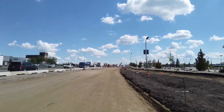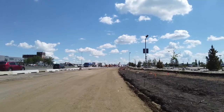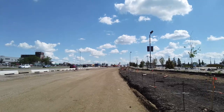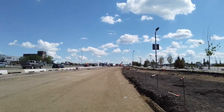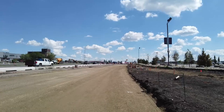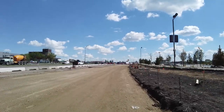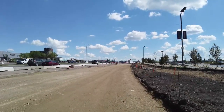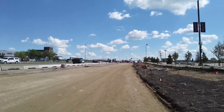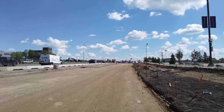That's a difference of 2 centimeters. If they use the trimming head, we normally leave it 2 centimeters high to give them a little bit of gravel to trim. But it turns out today they are not going to use the trimming head, so basically we are trimming this right to grade. The straight face curb will literally sit right on the material that we trim.